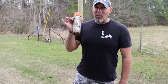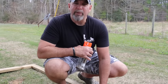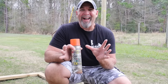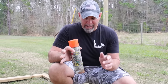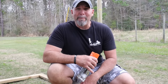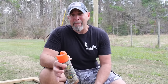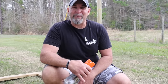So what I'm going to do now is take this marker paint, because out here you got to remember, this isn't going to be but an inch and a half. And I know, I cannot wait for the comments to start rolling in, because all the concrete whisperers out there are going to be like, you can't have organic material underneath your concrete slab. But you can. This is going to be foot traffic only. If it does settle, it's not going to be much, because this house pad goes way out here, and this is a little bit of topsoil dragged back in for the grass to grow. So I think we're going to be okay.